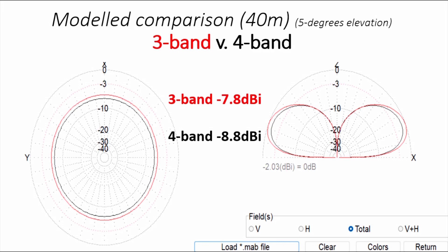Overall not a bad little antenna. Modeling puts it at about 10.65 meters total length, but I think it might sneak down to around 10 meters. If it fits on a 10-meter fiberglass pole, happy days. If you've got a 12-meter pole you can mount it a meter or two off the ground, which will help the higher bands — especially 10 and 15 — by getting away from the ground a bit more.